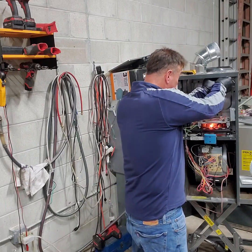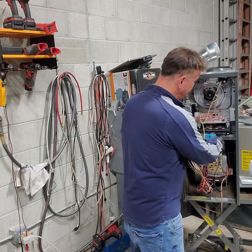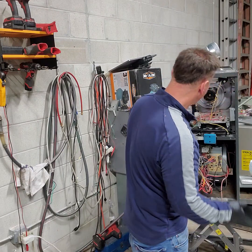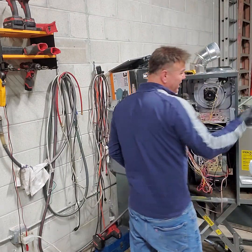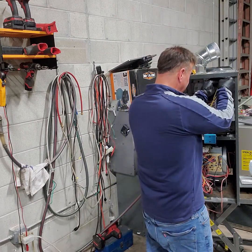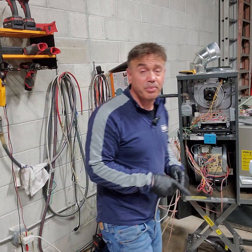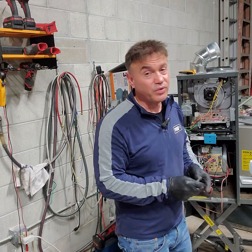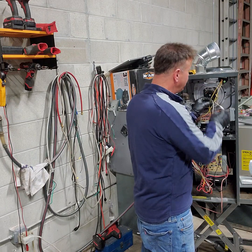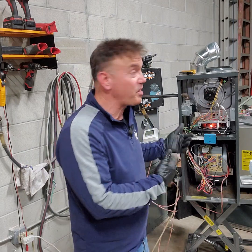Let me just show you something. I'm gonna remove this again one more time, and let's do it one more time. Now what you can do, I removed it. I'm gonna disconnect it from here, stimulate that there's something wrong, and let's say this is not closed. Now what you need to do, you need to jump it. So we do this only for diagnosis. We don't use it so you can have heat. We use that just for diagnosis. Like when I jump it and the heat comes on and the code goes away, I know the pressure switch is not closing.